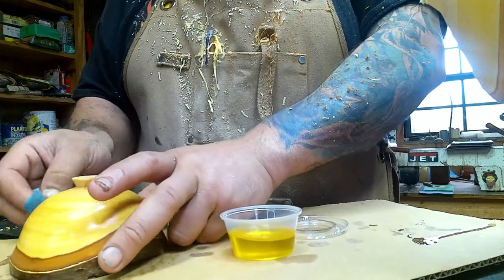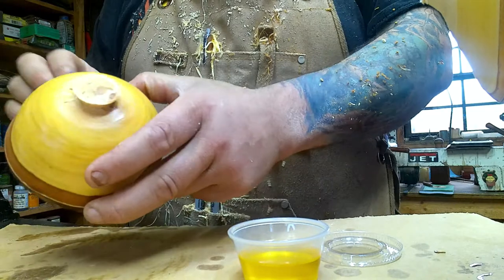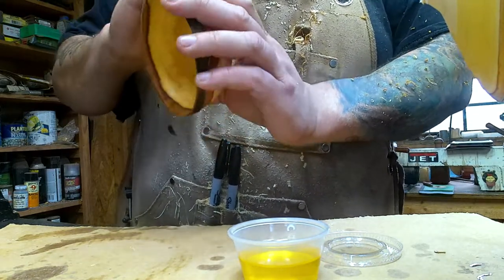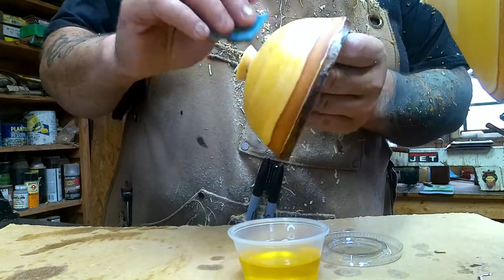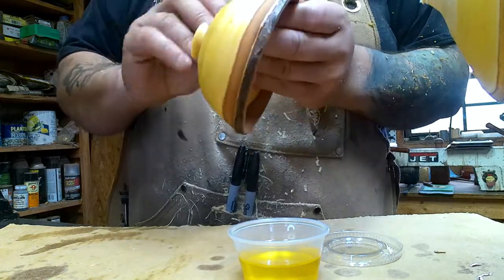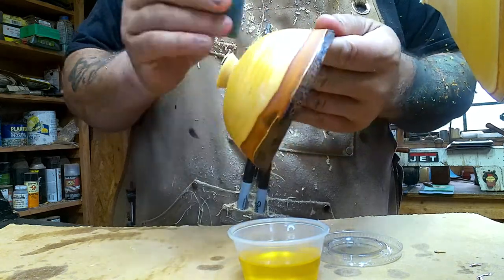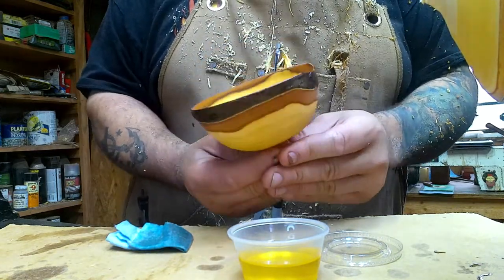And it will be water resistant. One of the nice things about polymerizing oils is that the molecule chains actually go through a process when exposed to oxygen, and they polymerize. They essentially turn into a plastic, a biological plastic. So again, this is Japanese Ornamental Cherry, green turned, and I am beginning a new-to-me finishing process, but one that has been tried and true.